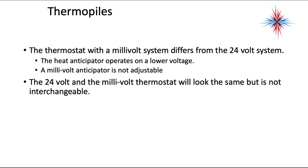If you're working as a service tech and have a millivolt system, you'll recognize it because there's no transformer, and you will not have 24 volts at the thermostat. Do not put a 24-volt thermostat on it because it will not work. Similarly, if you have a millivolt thermostat and need a 24-volt one, don't interchange them — the millivolt thermostat will actually catch fire if you put 24 volts across it.